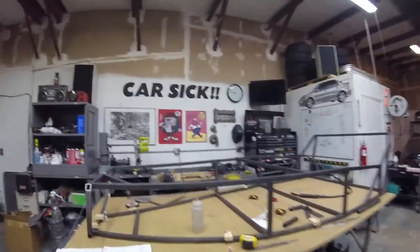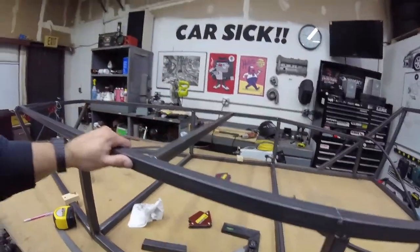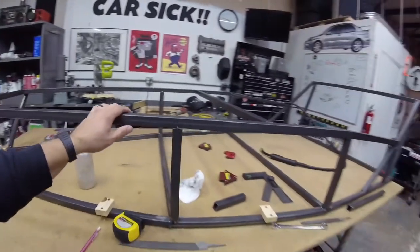All right, sorry I haven't been updating, but you know how it goes. Measure, cut tube, file, put in place, tack weld. It's kind of boring. But the outcome isn't boring. I got this tube cut, kind of just held in with magnets. This one's cut and tacked in. I think that was really all I've been doing so far.